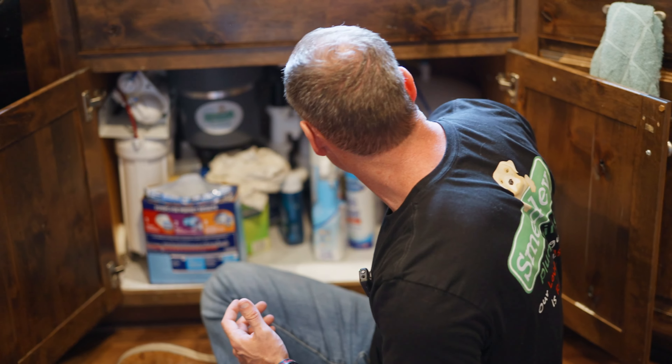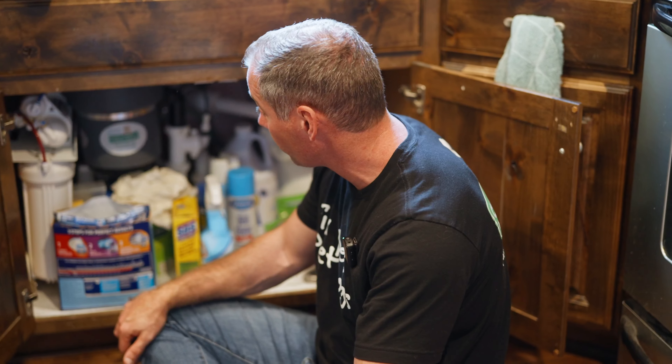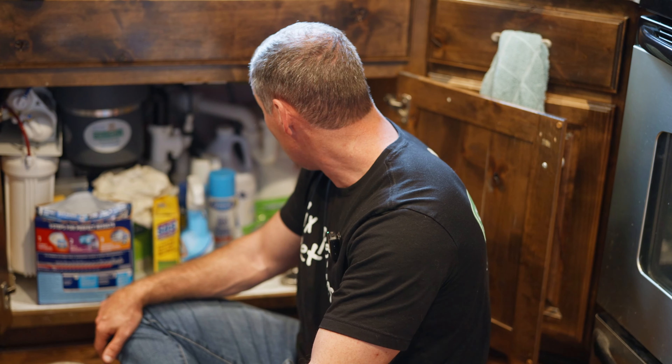This is my home so I have a rough idea of where everything was, but in a customer's home we have no clue. That was pretty quick — probably 10 or 12 minutes. It's really a fast process. Just be prepared for some water on the ground; throw some towels down. This is also a good reminder from the original installation videos: make sure the filter assembly is not sitting on the ground so it's easier to drop those canisters out from underneath. If you need replacement filters, there's a link in the description to order filters for your New Aqua water filter system.